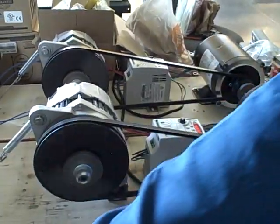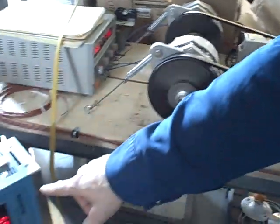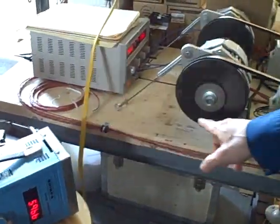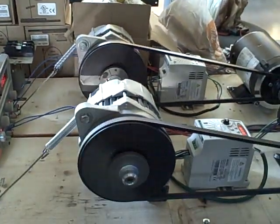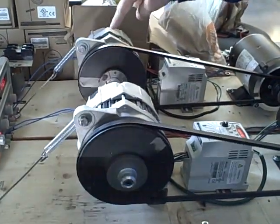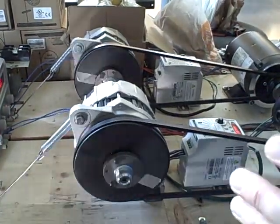You can see with our stroboscope here, flashing a bright light at the two generator shafts, we can see that one piece of tape on the shiv appears to be rotating backwards slowly. The other piece of tape is holding its position. So these two generators are now spinning at slightly different speeds.